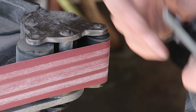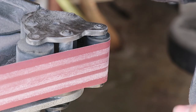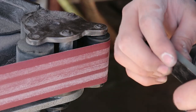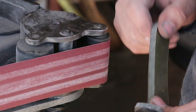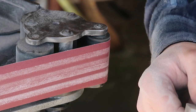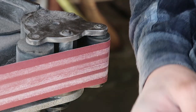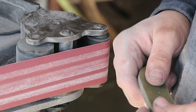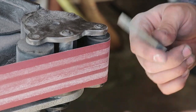Now you also will ask, well, I don't have a sandblaster, I can't blast my scales. You can also use a dowel and sand out all these little concaves or rocking patterns, or you can use what I also used, a Dremel with 120 grit. If this is enough for you, maybe you can go higher, or you just take a lot of effort and hand sand it. That's just the secret behind it. But with the sandblasting, it's just pretty simple and easy for me.